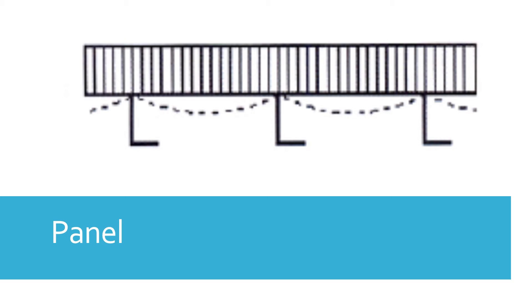When we talk about ship's panels, the water pressure results in forces on the plating so large that they cannot be absorbed by the plate without deformation or even fracturing. So plates have to be stiffened by stiffening profiles. A combination of plates with stiffeners is called a panel — as shown on screen, where you can see plates combined with stiffeners placed alongside at equal spacings.